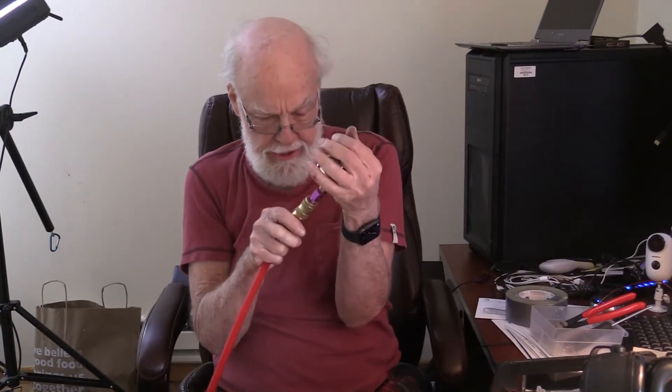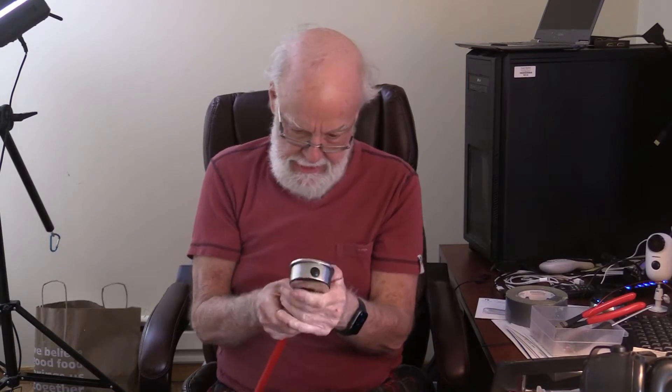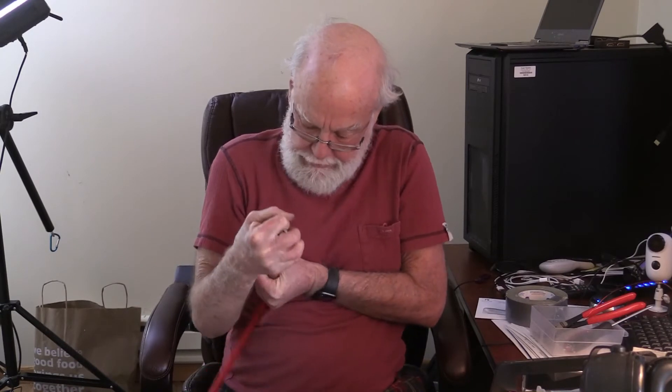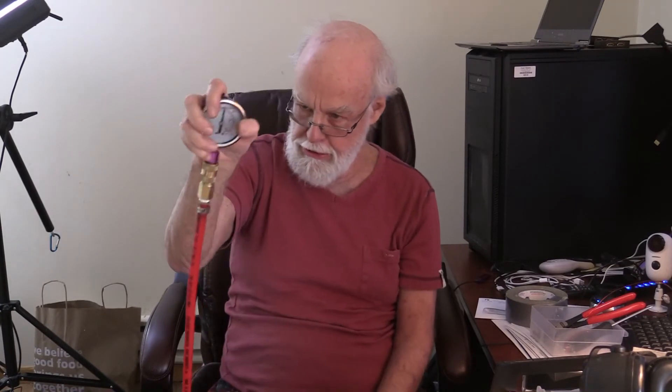The high-flow connection, I've got to tell you, it's really difficult. I don't lift weights or anything, but I think you'll have to. I imagine a lot of people, like me, just can't do it. I'm sure I could have when I was 20, but not at the age of 73. Whenever you're using an air tool you're obviously moving your wrist around — but look at that, it all turns together as a unit. So you're having to rotate the hose in addition to rotating the tool. That's not good.